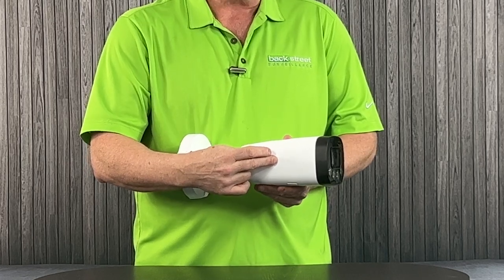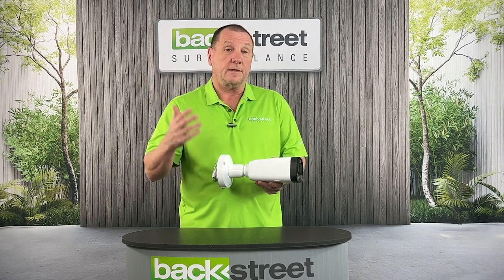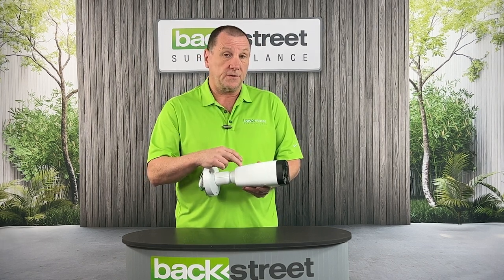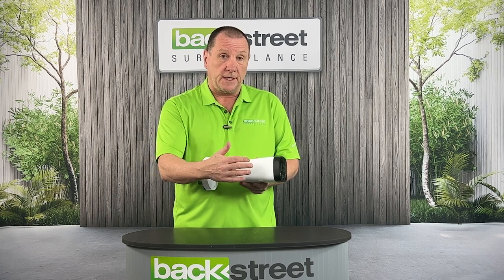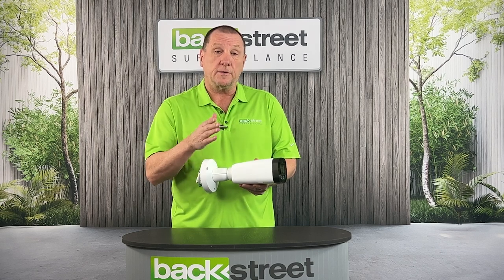Inside, it's got a video chip that will do 60 frames per second. Normal live video is 30 frames per second, and Hollywood movies are filmed at 24 frames per second. This camera will do 60 frames per second, which overcomes the blur that happens when plates are traveling. It also has filters inside that adjust for the glare from headlights and taillights and for the reflective nature of the license plate — all built in, on top of a powerful long range night vision system so the camera can adjust itself during day and night.